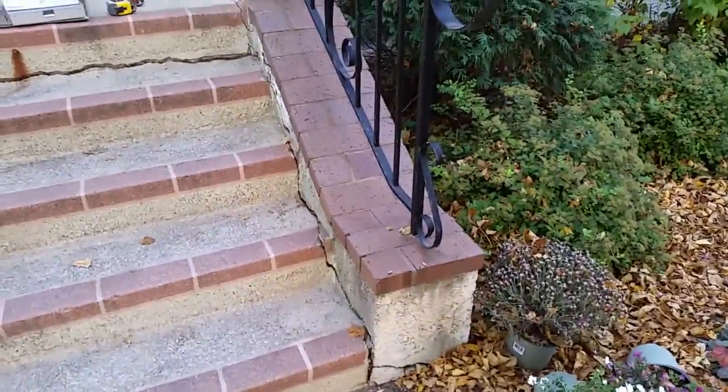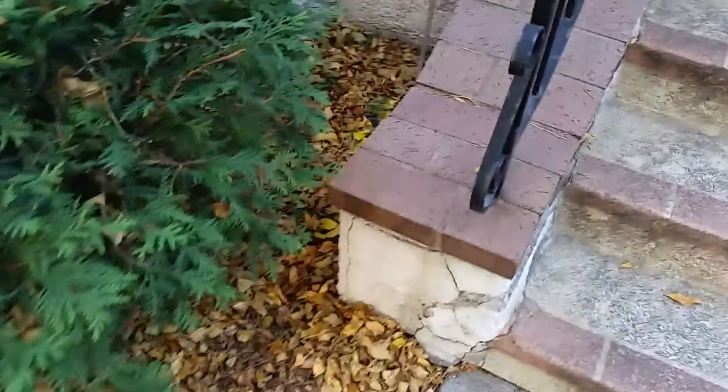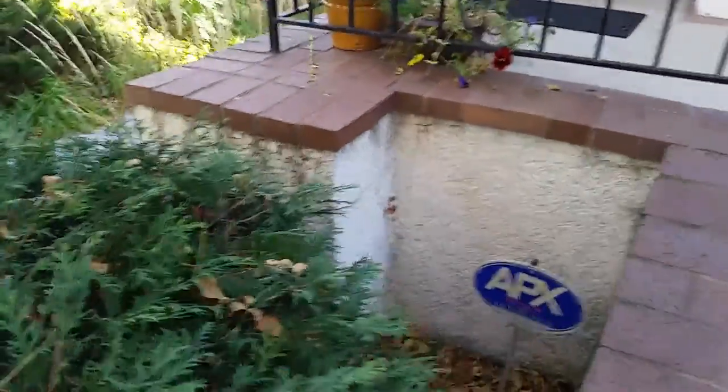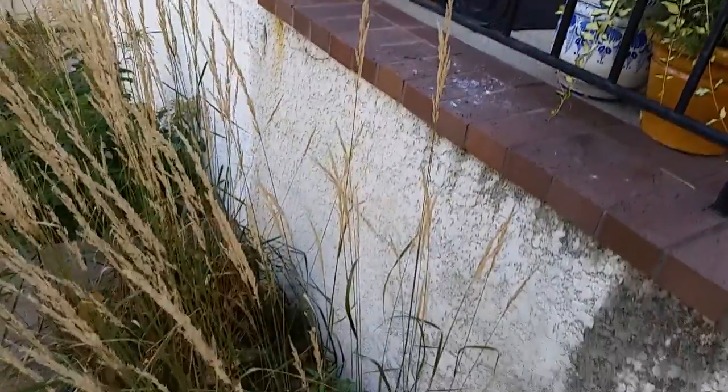On the side there are buttresses on both sides, one foot wide each, going up at an angle on each side pretty steep. It's 14 inches right here and goes up to 31 inches over here. It's a similar thing on the other side — about 14 inches — but the grade does different things over there, starting to slope toward their driveway. It's more like 36 inches over here and gets taller and taller as we make our way around to the back corner, where it's about 49 inches from that brick down to grade.